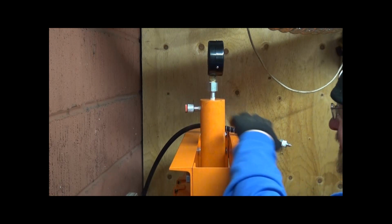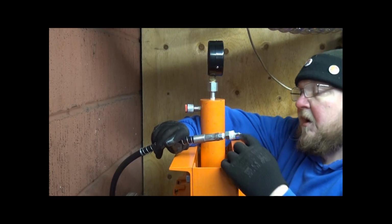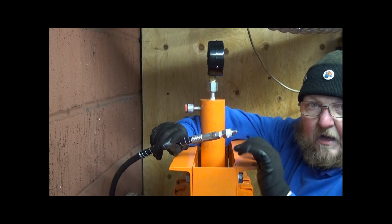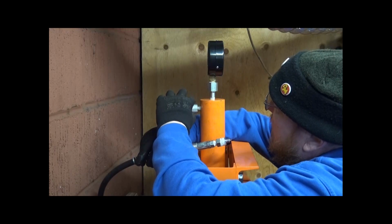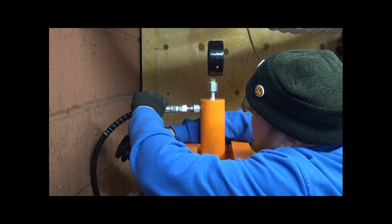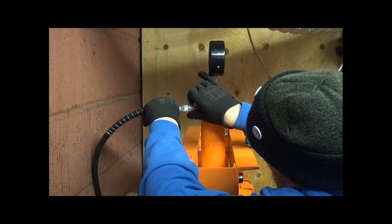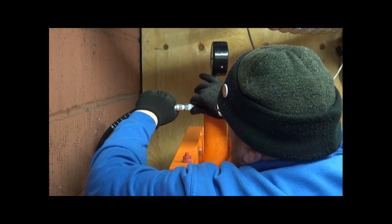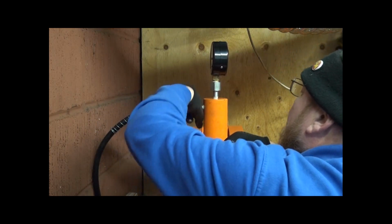Now I'm going to put the hydraulic pipe on the back. They have put a connector on there which they put PTFE on. I had to tighten that up because it was a bit loose. I then put PTFE tape on this part here, and that fits into here. Now you undo this knurled section, push it back and gently pull that out, and then insert that. Now what I'm going to do next is put that up and around there, if it'll go in. And now I'll start tightening that up, which will pull that little brass section in to the valve.